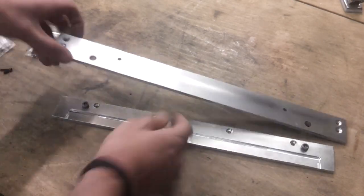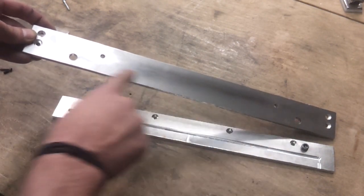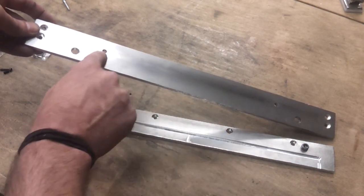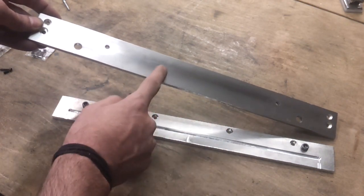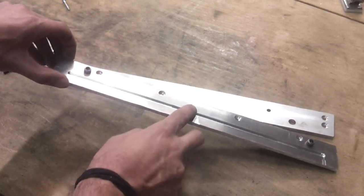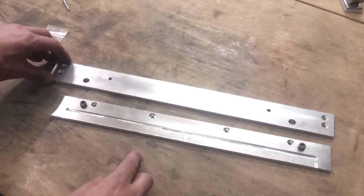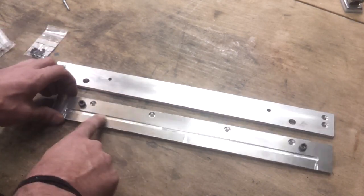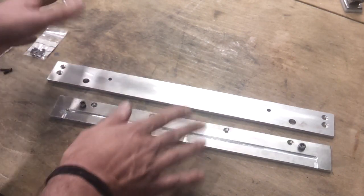I've already prepared a couple of plates. The moving half has a 6mm wide channel about 3mm deep, 360mm long, with some vents and a couple of guide pins. The matching fixed half has holes to take the guide pins for alignment, and then there are the feed points — these will produce a small sprue that will tend to pull the moulding onto the fixed half side. However, all of the geometry is in the moving half, so that's going to tend to pull the moulding the other way. The question is: in this tug of war, are the sprues going to pull it off onto the fixed half, or is the cavity going to win?